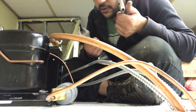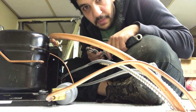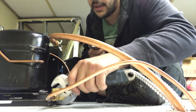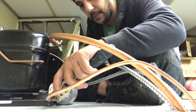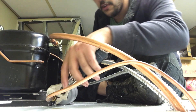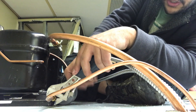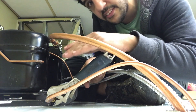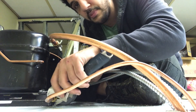I know you're not supposed to use adjustable wrenches, but I just don't feel like going back to my van and getting down off this walk-in cooler, so I am going to use the crescent wrenches because I have them handy. Now when you are tightening these, you always want to tighten the nut — do not tighten the sight glass and filter dryer. You want to hold the sight glass so it doesn't move, because you want it to be facing up.